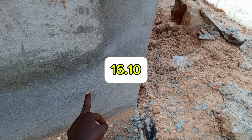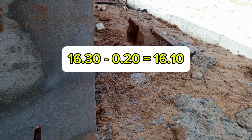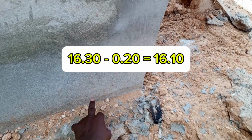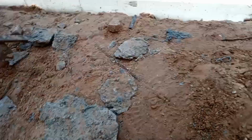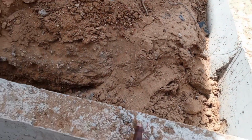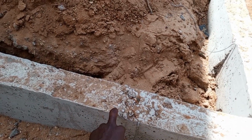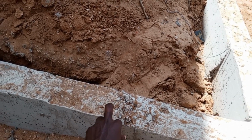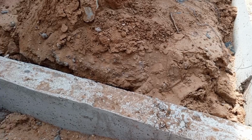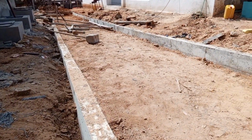So this is 1630 minus 20, we will be able to get 1610. So from this nail we subtract the 20. That level we transfer it at this point. So this is our channel level, and which is also our walkway level. So that is how we come up with the levels for the walkway on this side.